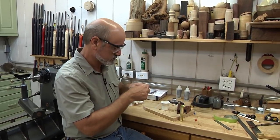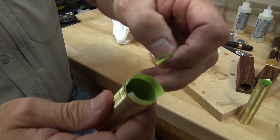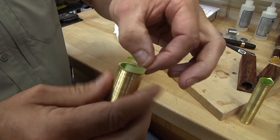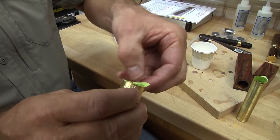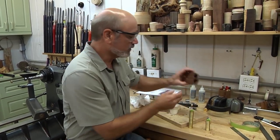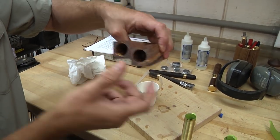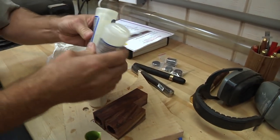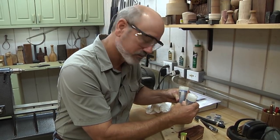I'm doing a little prep here — putting some tape just on the inside of the tube because when we use the two-part epoxy, if it gets inside the tube the kit won't fit together well and you'll have problems. People have seen comments on the internet where they're going 'this doesn't fit' — well if the epoxy gets in there, it bumps out the whole thing and it'll never work. They recommend something like Play-Doh, but I wanted to go with tape. I marked the top parts of the tube because I want to match the grain as best I can. We're going to insert the tubes and use a two-part epoxy — I've got my little Dixie cup here. You want equal amounts. This one has a five-minute working time, but it takes an hour to fully set up.